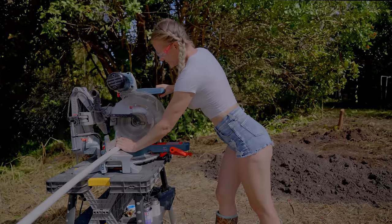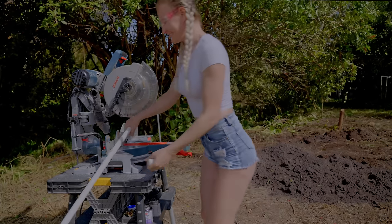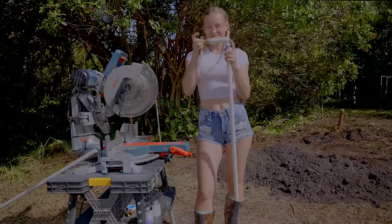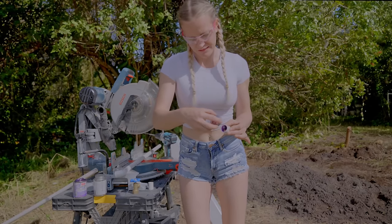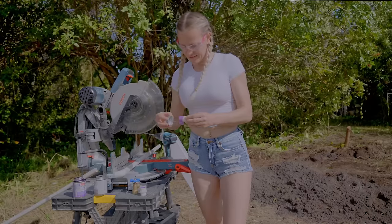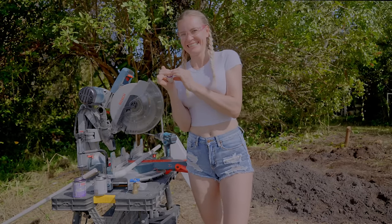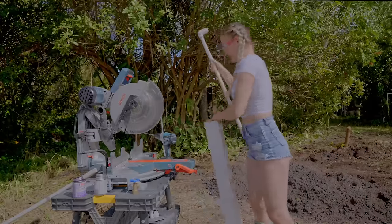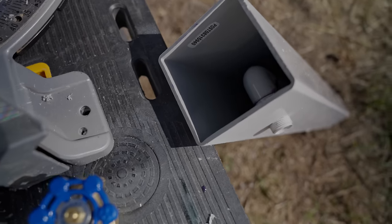Now you need a very small piece that goes from the 90 degree to the spigot. That should be the perfect size, and this is how it will look like. The whole setup will be covered by the sleeve, so we have to cut a hole into the sleeve so the spigot can go through. Glue everything together using the PVC glue, and always make sure you hold it together with a little bit of pressure, since the glue will try to expand and push the pieces apart.